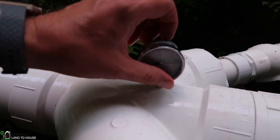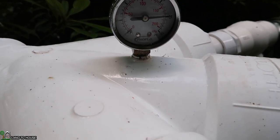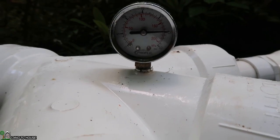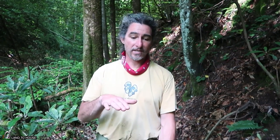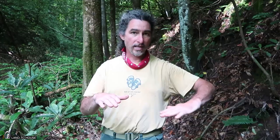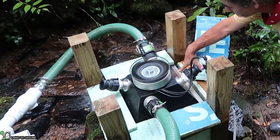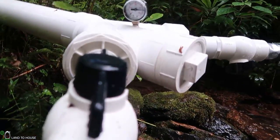There's a pressure gauge that I installed here in the tee and that just lets me know what's going on. It's nice because if there's an issue with the power up at the yurt, I don't have to necessarily go to the Coanda box since it's pretty much maintenance free. I can come down here and see the gauge, and if the gauge comes off of 25 PSI, I know there's probably some air or something that's gotten into the system. I can shut it off and start evaluating problems from there. Spencer Langston built this turbine based on the flow rate and all the parameters of my system. I have done some tweaking — I cut some off of the stand because it was about 12 inches higher, with the pipe probably 10 inches lower. Just by gradually raising the pipe level up and lowering the turbine down to get those more in line, and decreasing the length of the two flexible pipes, I was able to gain probably 30 to 40 watts. It's really amazing what little tweaks will do.